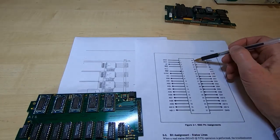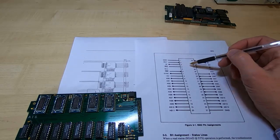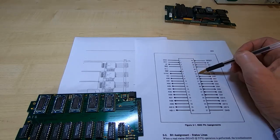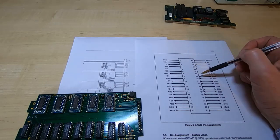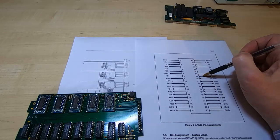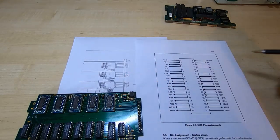So if we start here: 1, 2, 3, 4, 5, 6, 7, 8, 9, 10, 11, 12, 13, 14, 15, 16. So pin 15 is DB0. If we say pin 40 equates to pin 1 here, all you need to do then — because these pins are in the correct order, alternating side to side — is create a cable that just alternates side to side.